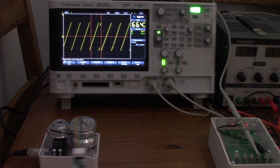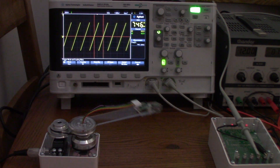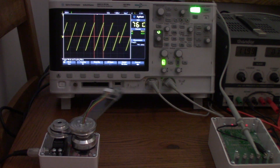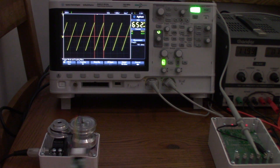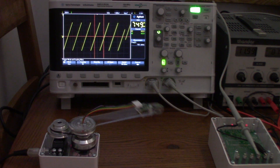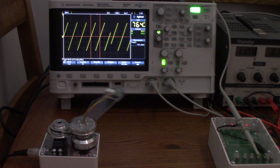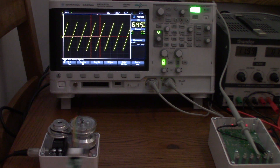We've got 90 microseconds offset. The frequency reads 740 millihertz — let's do one more scan to make sure it's stable. It's varying a bit: 735, 734, 736. As I said, this is something you'd be doing in the lab yourself. I'll put down 735 millihertz for that.